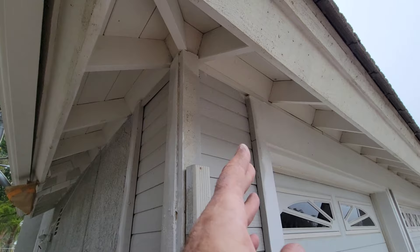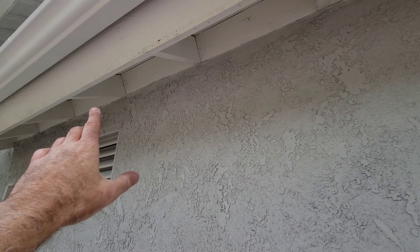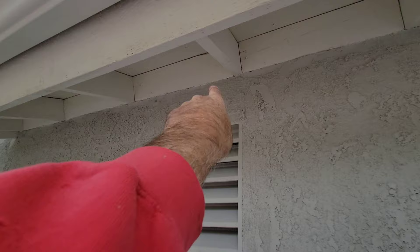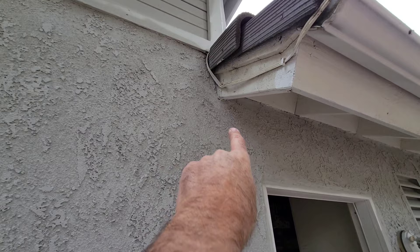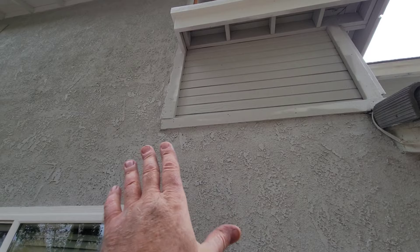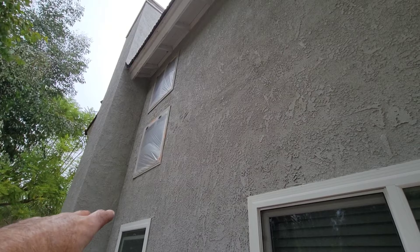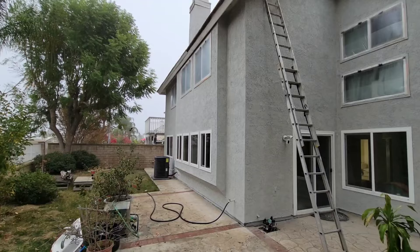We painted the stucco and the eaves yesterday and when you do that all in one day you really can't mask the stucco because it's still wet, especially this time of year — there's a lot of fog. So rather than go home early we went ahead and painted it shielded. The guys wanted to mask it and I said we can't mask it, let's just shield it. Now we're going to go through with a brush and tighten it all up. Where you see a little bit of stucco showing in there — that's not acceptable — we go through with a brush and clean it all up. You just thin your paint down. I'll be up there doing the trim, cutting in, doing my two brushes — one in white, one in the trim color — and finish it all out as I go.